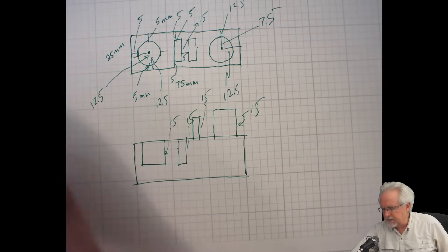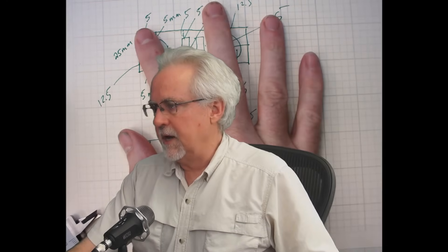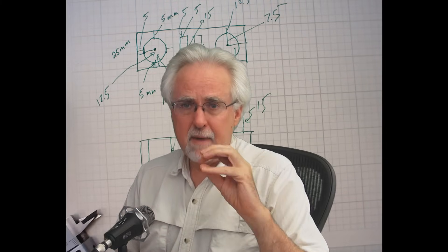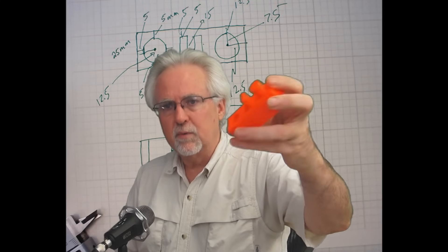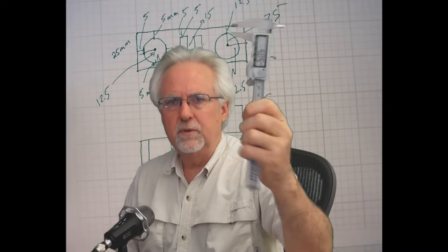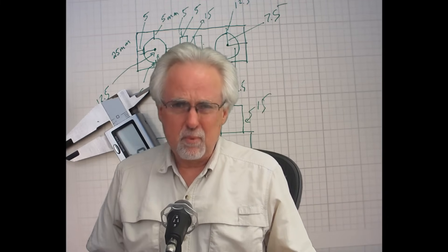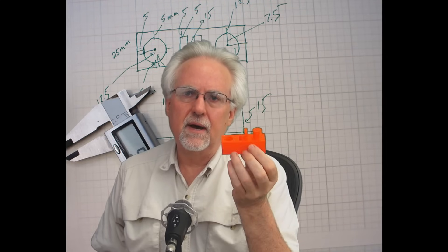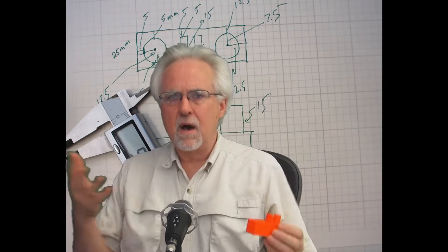What I hope you can see is that in our mechanical engineering work, the workflow is: first sketch things on paper so you have all your dimensions and locations, then put that in SketchUp being very mindful of dimensions, locations, and keeping things symmetric and neat. Then print to the 3D printer or fabricate, and after fabrication do an evaluation. What I conclude is that for most things I'm about 0.1% accurate in achieving the target dimension. For circles and extruded pegs, maybe more like 1% — so between 0.1% and 1% precision overall.